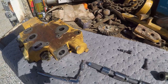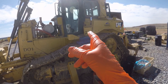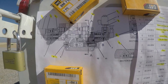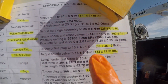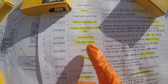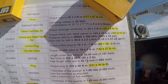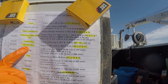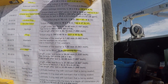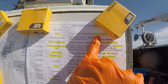Unfortunately it's got the four valve bank in there — when we get in there together it's tight quarters. This is worth noting: we've got our little schematic here of the valve and our torque specs. That shuttle valve only torques to 142 inch-pounds, which is like 11 and a half foot-pounds — just under 12 foot-pounds. Usually anything under 12 to 15 foot-pounds you'll get your measurement in inch-pounds, so 177 inch-pounds.